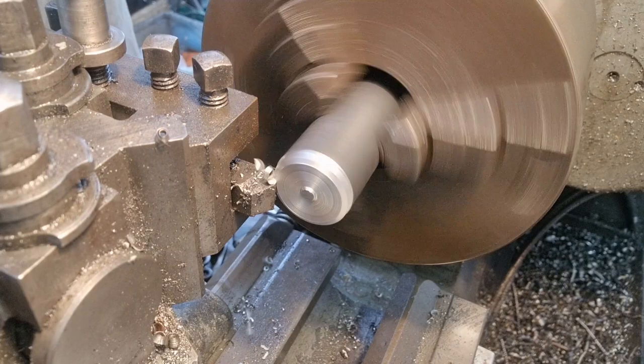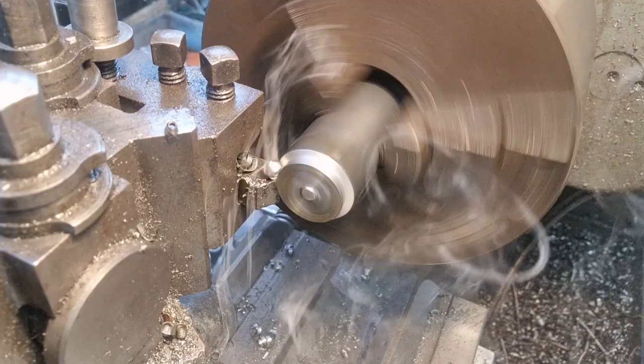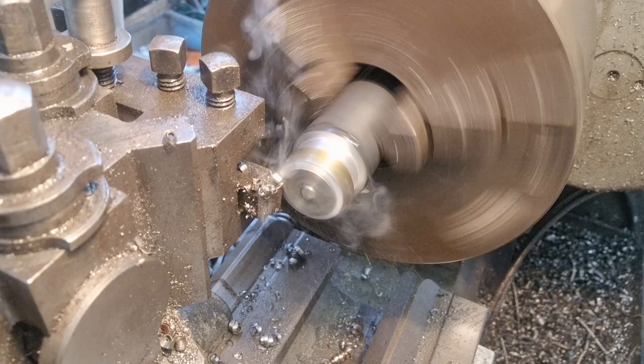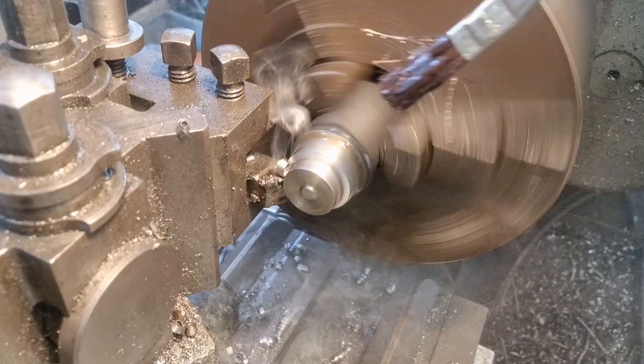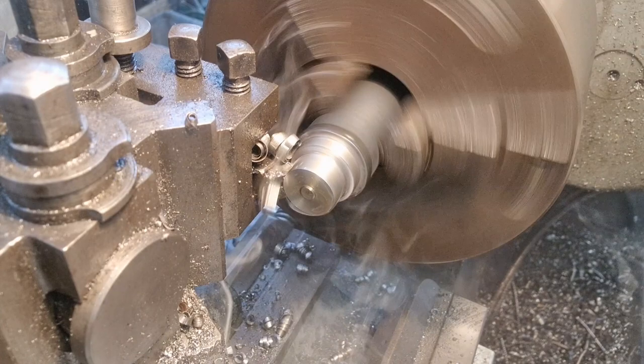A little bit of lube. Because that's where it separates us from the animals. And you can join me again once we get onto the next size down. 19.5 for 10 mil long. So just touch off at that. And there she starts cutting. Another bit of lube. There's 5 mils, halfway there. 6, 7, 8, 9, 10. Bang on. Happy days.